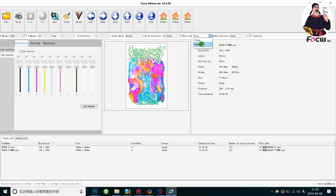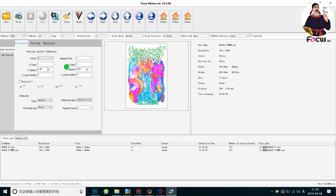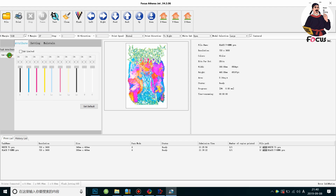That means this file was processed and ripped by CMYK and white ink, so you must open the white ink option. Then we select the file, go to ink attribute. Here you can set the white ink density as you want. Normally we recommend you print by one or soft hand feel, and print by two to get the best white ink density but harder hand feel. That depends on the customer requirement. Then we go to ink limit — here you can control the ink limit. You can cut down the white ink density to print less white ink for better hand feel, or set to zero to keep default. Zero means maximum white ink; the bigger the number you cut down, the less white ink comes out.